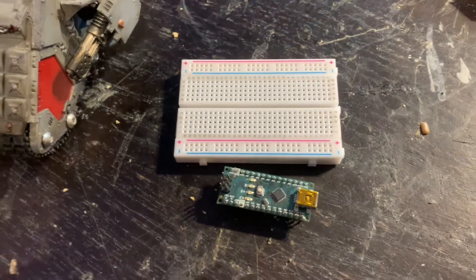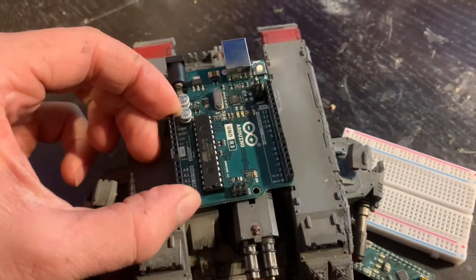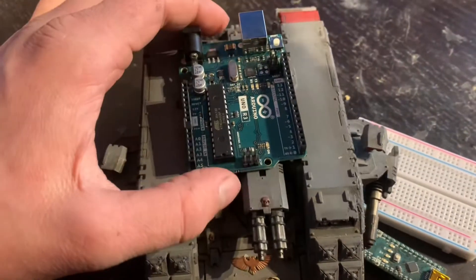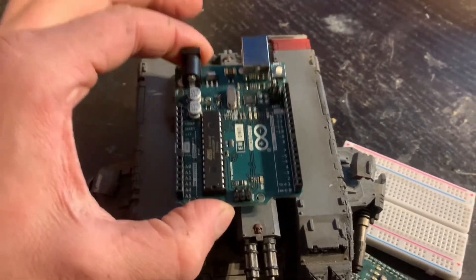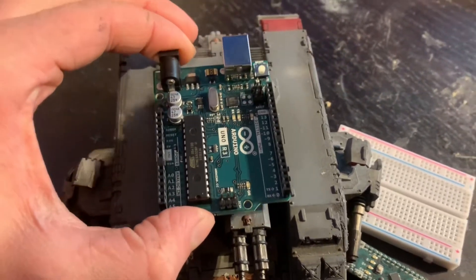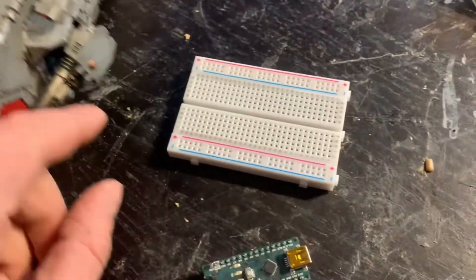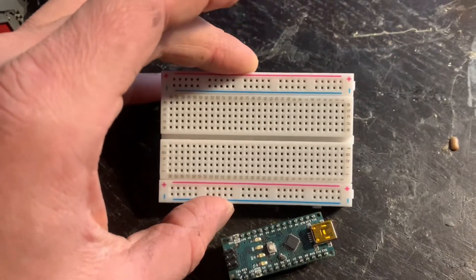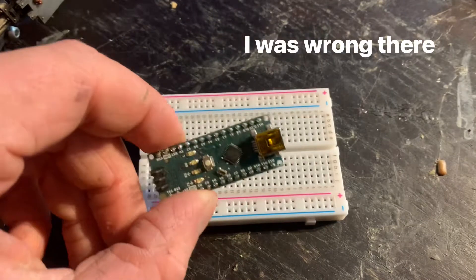For the Arduino control boards, I would like to use an Arduino Uno, but it is slightly too big for a Land Raider — maybe by about 5mm, just too wide to fit in the centre. Hopefully if I do a future video with the Spartan Assault Tank, which is slightly bigger, it will fit. The Uno comes in starter kits so it would be easier to use. So instead I'm going to use an Arduino Nano — a lot smaller. I'm going to try and use a breadboard; while it isn't a permanent fixture it makes it really easy, easier to pin, and you don't have to do any PCB boards or any soldering.